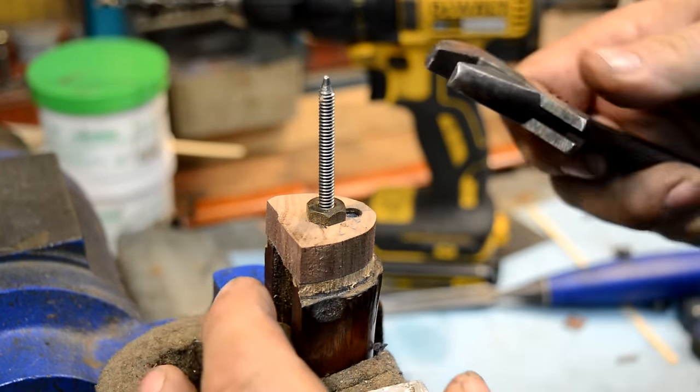Okay, so let's go ahead and continue cleaning the rest of this up. I'll roll this up so you can see what I'm doing. And now all this is underneath that barrel band. Okay, you have to take slicing cuts here, because what you don't want to do is have this chisel blow through this clay, bang, and hit that there and drive a scab off. And I'm going to tell you, I had to learn that the hard way over a long period of time. Let me just peck this off.